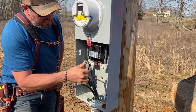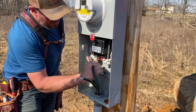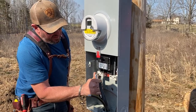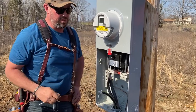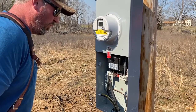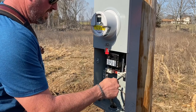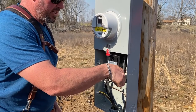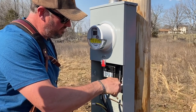Anyway, so these kind of lugs, especially these big boys, after a few weeks, a month of service, I come back and torque these again because they always seem to loosen. So you want really good contact. You don't want to have some loose connection there arcing, sparking, or causing a bunch of resistance. That's way too much current to let that happen.